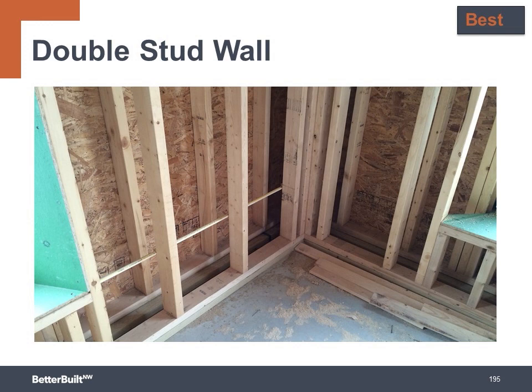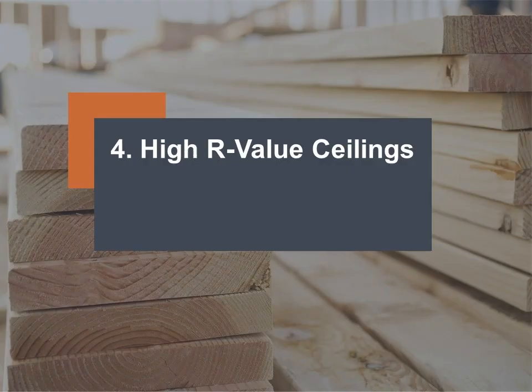They either need to fill the wall cavity in a series of lifts, building it up towards the top to achieve the required density because the whole wall cavity is connected, or they may install netting between the studs to create bays that they can fill up as they normally do to get the density of insulation needed.